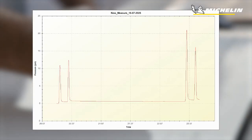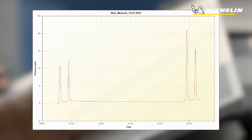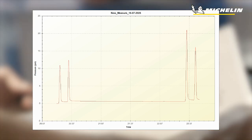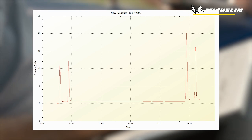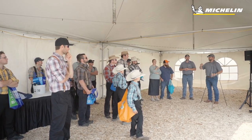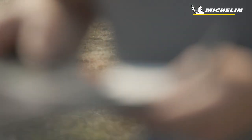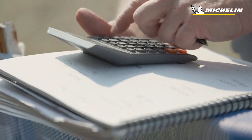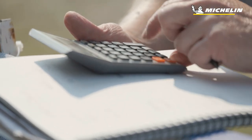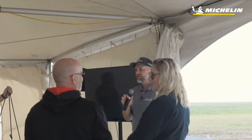You can see here we've got them compared. Here's the first run with the Axiobib 2 tires — we're just measuring that inside dual, that's all the probe can catch. We're getting a comparable spot within the Axiobib 2 and the LSW. You can see here's where the front tire and rear tire of the Axiobib 2 hit, and then you can directly compare over and see where those LSW tires were in terms of ground pressure. We're going to get a percent difference — any guesses on how much lower the Axiobib 2 front tire pressure was?